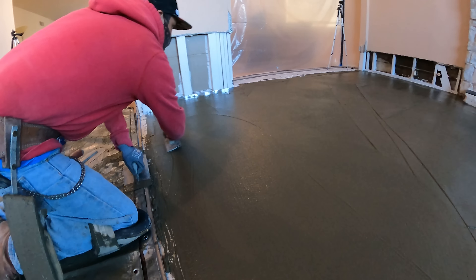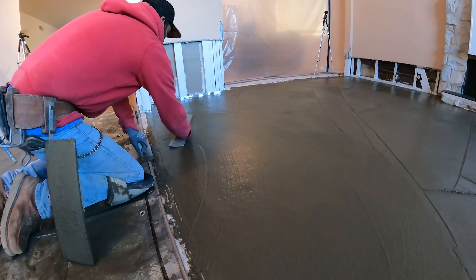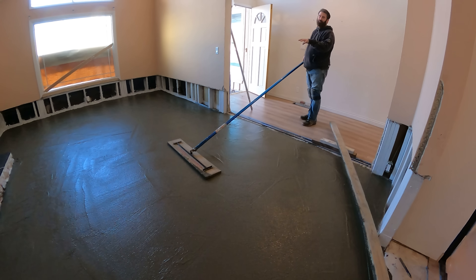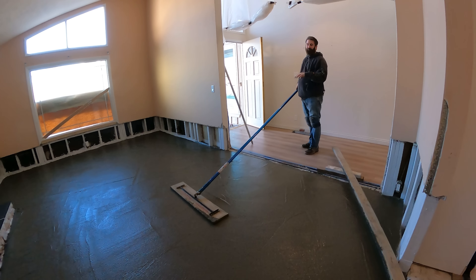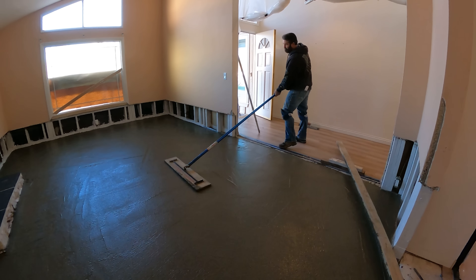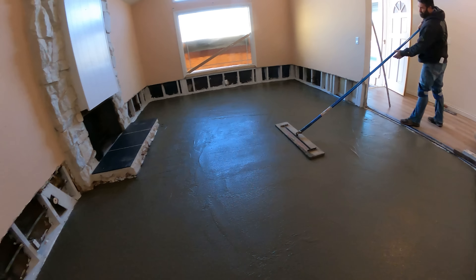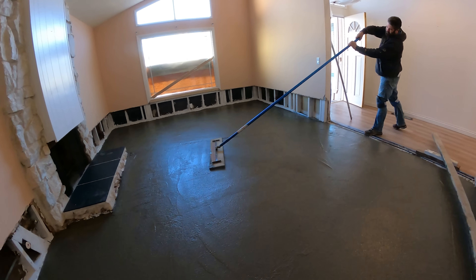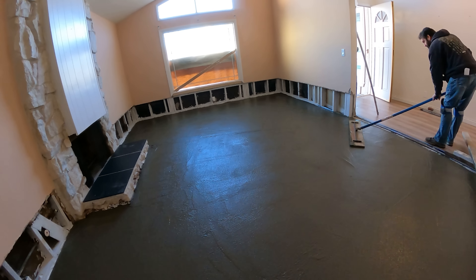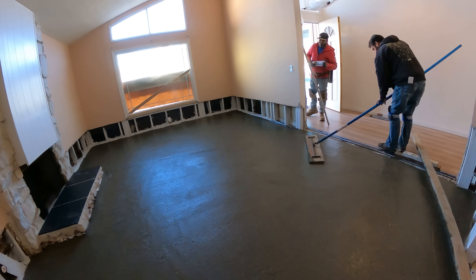Make sure you stay tuned for how to enter the contest to win a tool, because this is subscriber appreciation week tool giveaway time. Second pass on the bull float about an hour later after the first bull float. This is our second pass — try to level it out. You can see there's not much water on top right now, no bleed water. This is the perfect time to hit it again with the bull float — now you can really work the paste, the cream around, and fill in any low points that you may have.